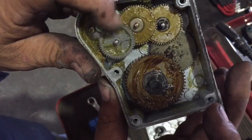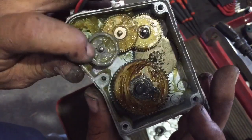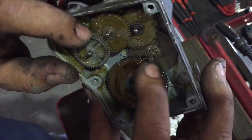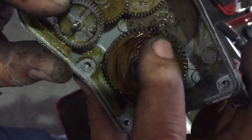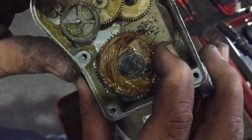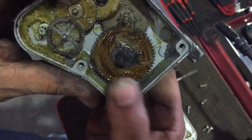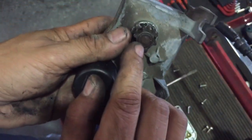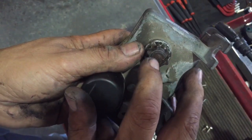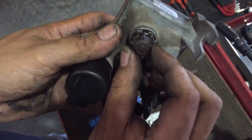This gear turns — and there it is, the broken one right there. Broken tooth. I'm going to push that pin out of this sprocket. I'll use a chisel, set it right there, spray it with lubricant, put it on the vise, and just slam that shaft right out of this gear. It'll fly out the back — we don't really care about that. We want to save this little gear right here.